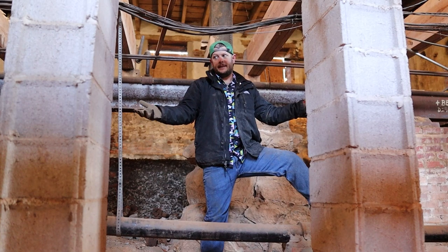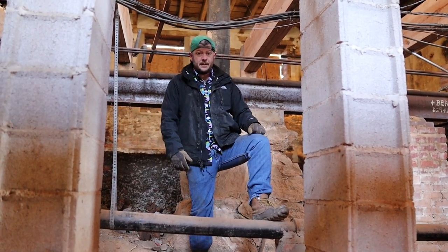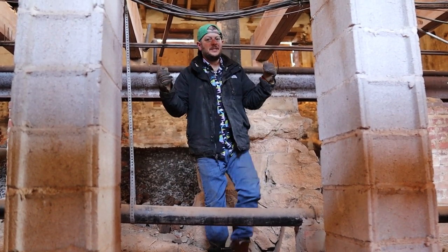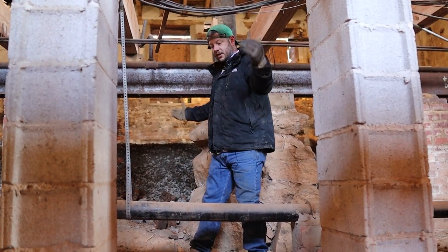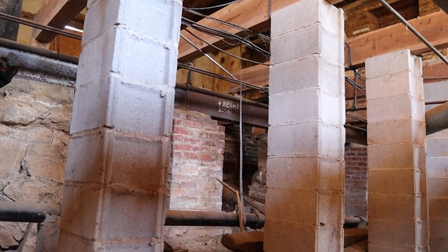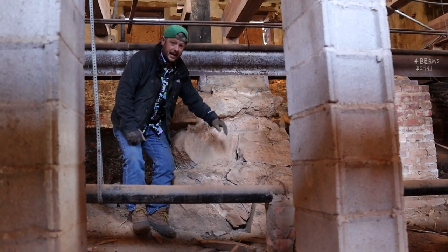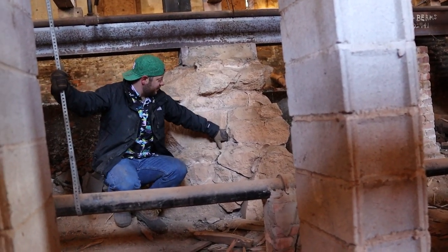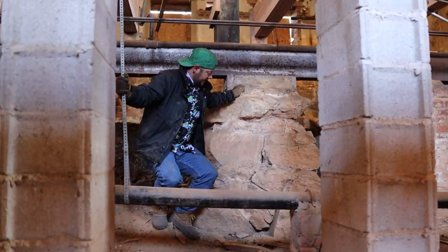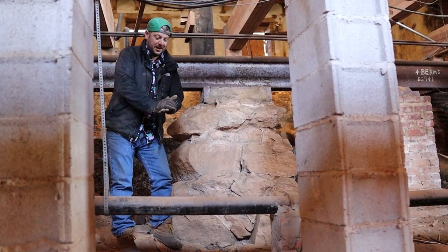We may also be able to sell some of that historic lumber — we've got thousands of square feet of it, so check us out at our website and send us an email. Once we got the floor uncovered, we got a really good, bright, open look at these old footings. The outside walls are very secure, almost 30 inches thick. But the center posts that go down the building are mostly held together with stacked stone footings — stacked stone means old as anything. I could get my whole hand in between these granite blocks. The engineer is not super happy.